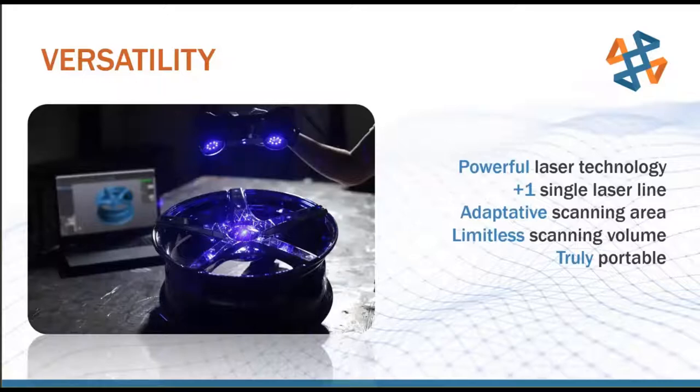With the addition of these more intense blue lasers, as well as improved mesh building algorithms on the software side of things, we've greatly improved our capture of shiny surfaces and dark surfaces. So we're able to get those two classes of surfaces much easier with the new scanning technology. Clear surfaces are still going to be something that cause some issues at this point. The lasers still just pass right through the clear, and then the cameras really don't have anything to grab onto.